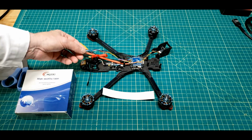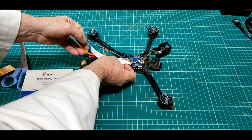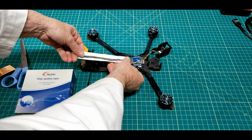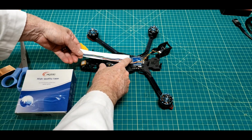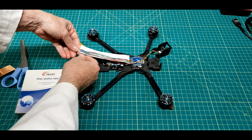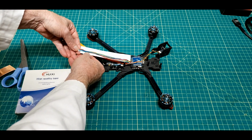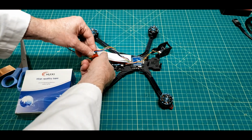I'm going to give the wire a little twist. Then I'll put this in there and start taking my backing off. But what I really want to do at first is just get the wire stuck along the side, like that right there. Just want to get the copper stuck to the wire for the length, and I really don't want it touching the connector up here. I'll have to cut it just a little shorter on each end so it doesn't touch any ground up here or any of the pins that stick out a little bit back here.